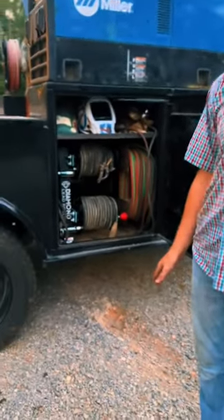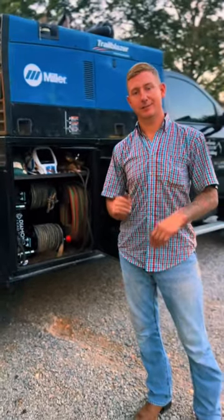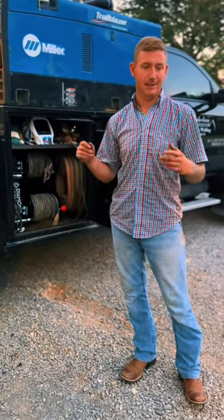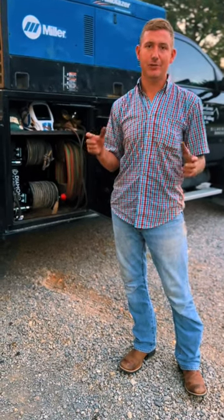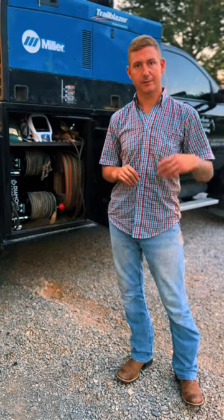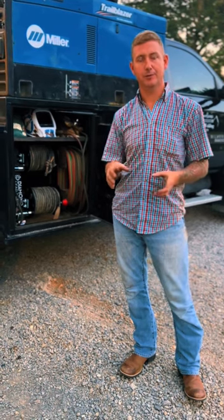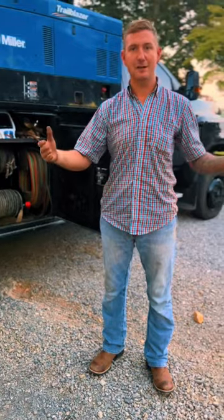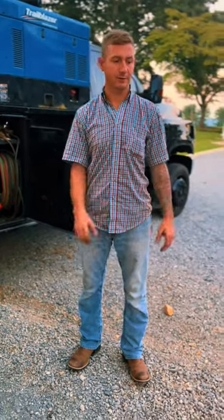I do a ton of arc gouging. If you get lead reels and it's your first set, here's the tip I learned the hard way: you don't want cross arcing. What I mean by that is, if you're running 80 or 100 foot of ground, 80 or 100 foot of single lead, you don't want to leave 75 or 80% of your leads rolled up on your reels. You want to drag your leads out — that helps them air out while you're welding. They stay cooler and you stop yourself from cross arcing.